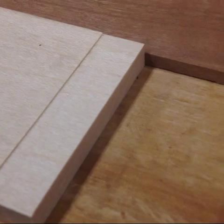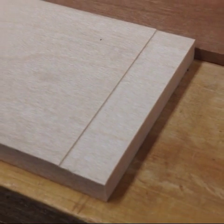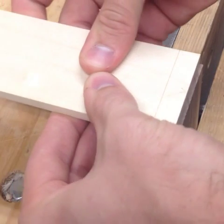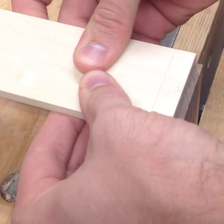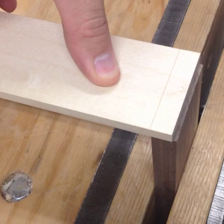There's a close up of the rabbet — everything clean and square. We're going to use that small shoulder to register the board. There's the end result of the rabbet you cut. The board registers against the shoulder, keeps everything square and aligned, and makes transferring your marks straightforward.